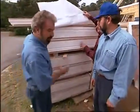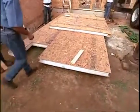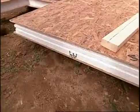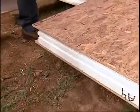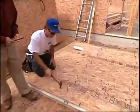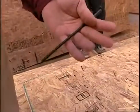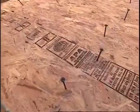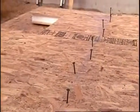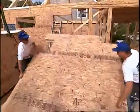And the sidewall panels are the ones you got down here. They're a different thickness, right? Right, the sidewalls here are 4-inch thick panels, which is pretty typical for a wall panel. Now, what are they driving these screws in here for? The screws are what actually hold the panel to the timber framework. Right, they're using these hardened screws, and they're just driving them right through. They've already snapped lines where our posts are, so when they lift it up, they'll drive these screws right into our frame. Okay, and this is one section, and it goes right in front of us here, all right? There we go.